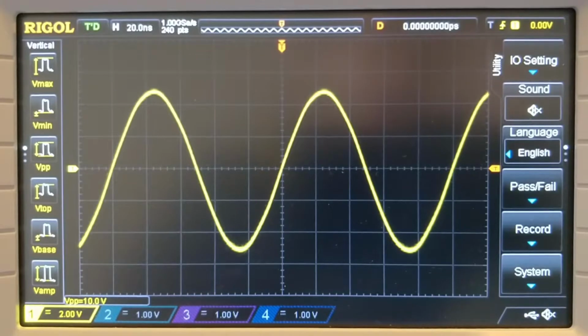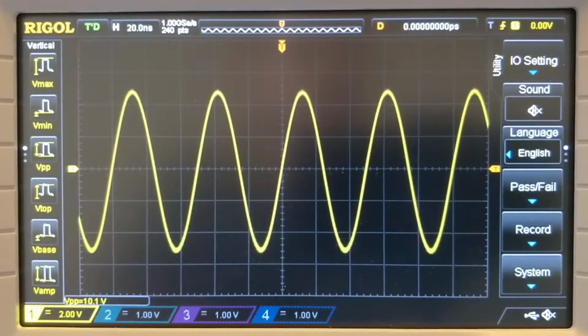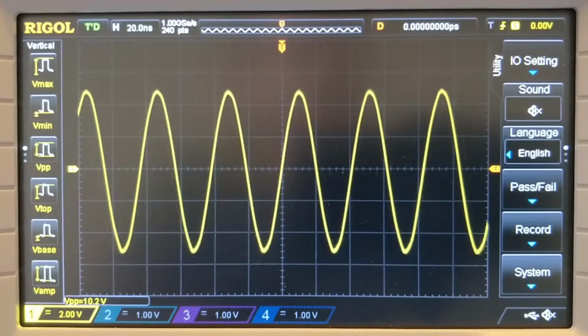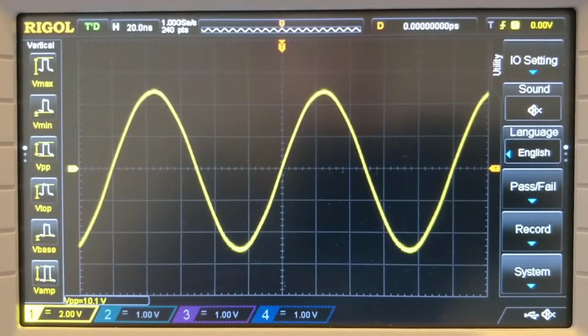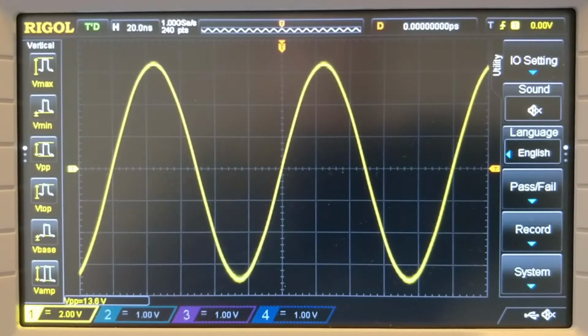The op amps on both channels have now been replaced. We're looking at a 10 MHz sine wave here, 10 volts peak to peak. If I start to increase this, got 16 megahertz, 17, 20 megahertz, 21, 22, 23, 24, and we're still holding that 10 volts peak to peak. Alternatively, if we go down a little bit, back to 10 megahertz again, we can also change the amplitude here. So we're on 10 volts at the moment. Let's go up a little bit to 11, 12, 13, 14,